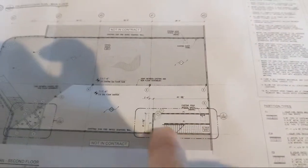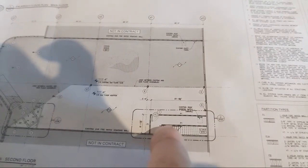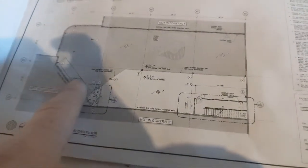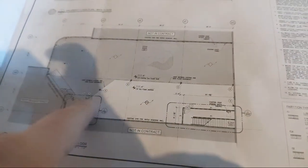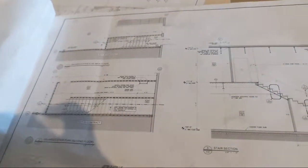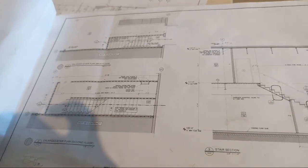So we built this. Yeah, no, it's okay, Dibs. We built this one, and when we've built this, it has to be drywalled. This doesn't get plywood anymore, so it's gonna look kind of funny. I would have set the back wall on the main floor in 5/8 so that we'd have a flush finish, but that's not gonna happen.